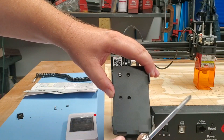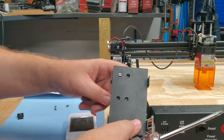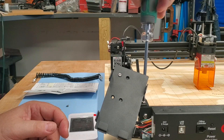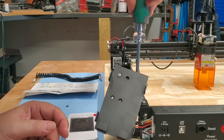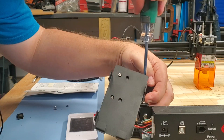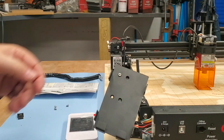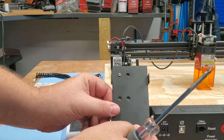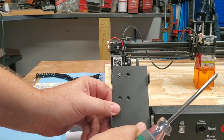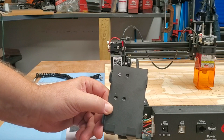I'm dubbing over the original sound in the video because I want to mention a couple things. The first thing is I'm always using the term 'online controller' — it's actually called an offline controller, so just ignore 'online' and think 'offline controller.' Now the other item: if you have the Z-axis modification like I do and it did not come with the extension plate, then you had to physically move the bracket — the limit switch bracket — back towards the other X-rail a couple centimeters or about half an inch. This pushes the whole offline controller mount further towards the X-rail on the motherboard.